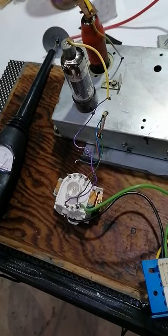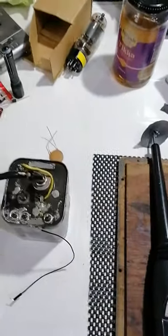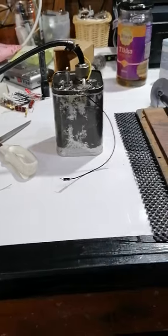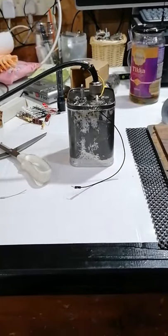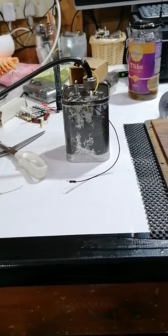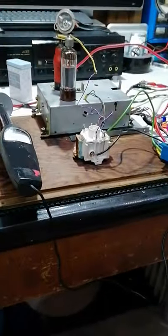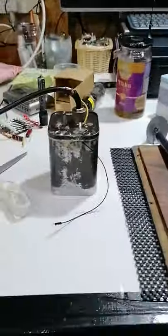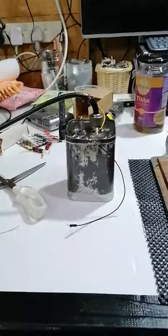I've come up with another idea which I'll try before I do anything else. It's to open this back up, take out the diodes, take out the capacitors, and just leave that as a ring and transformer. Then use the tripler externally. I know that's not exactly how we should be doing it, but there's an awful lot with vintage stuff that we cannot do, because we cannot get the bits that we require. We can't get another can, we can't get the right capacitors, and putting those capacitors in there was a bit of a nightmare. So I'm thinking of just taking everything back out of this can, leaving the transformer there, and feeding this tripler from there. That will reduce the voltages floating around in the can.